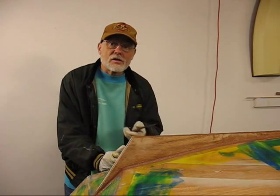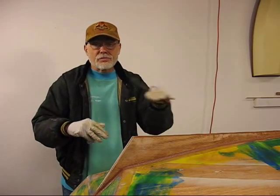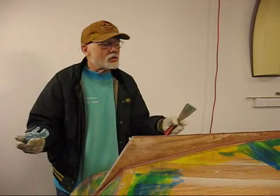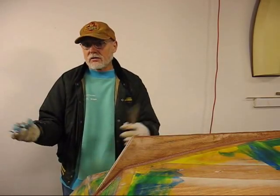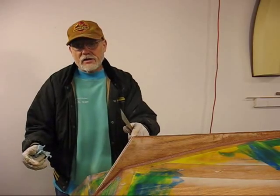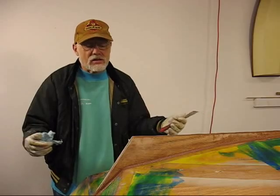Basically I wanted to get into the voids that the Gel Magic didn't fill up, and then any spots that weren't form-fitting to the hull — those are nice and easy to fill, and they'll cure out. Then I can come back and give it a preliminary shaping and sanding, maybe put on another layer and shape it, then lay probably a layer of glass tape on it. I think I've got a lot of six-ounce cloth left over.